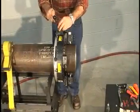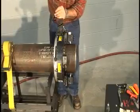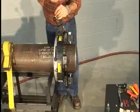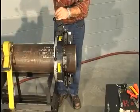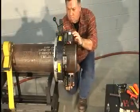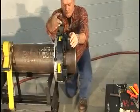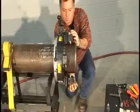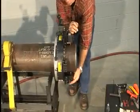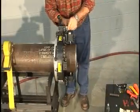The tripper assembly is now mounted in the machined slot on the body ring. Check that the tripper pin has full contact with the star wheel on the tool slide and that it is positioned approximately half the distance into the star segments. The base can be adjusted in and out, and the tripper pin can be adjusted up and down to achieve the proper distances.